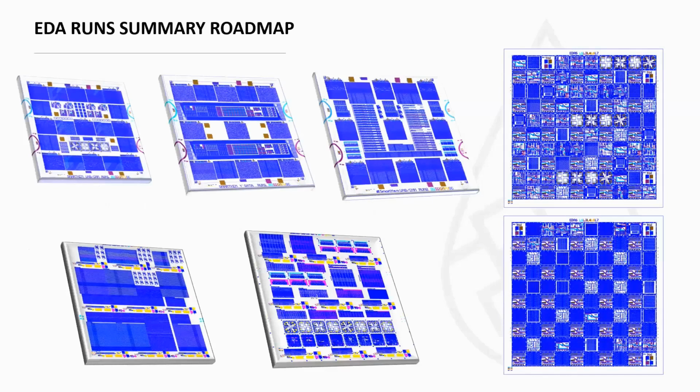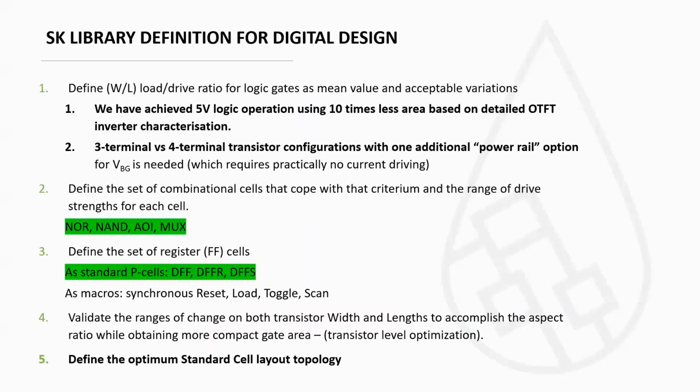So you can see some of the designs we've been working on. These are mainly for parametric extraction and getting some of these DRC checks, design rule checks, that we need as part of the description for the PDK that will then feed the EDA tools, as we discussed. Some of them we're looking at smaller dimensions, transistor uniformity. We were trying some QFN pads. So these are basically to test more ASIC-like devices. And then we're also doing things like connectors for reliability and humidity testing. So we can customize the layout with a quick turnaround, thanks to the direct write lithography, and chiplets, which are about 9mm by 9mm. These designs are normally 4-inch, but we also have, as you've seen before, 8-inch and 12-inch capability and Gen 2 prototyping.